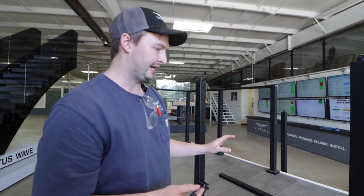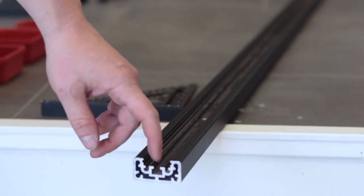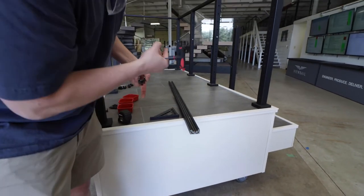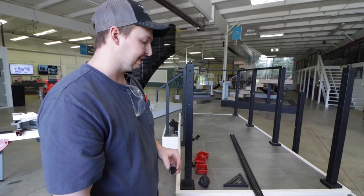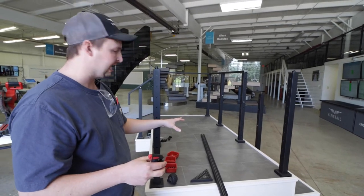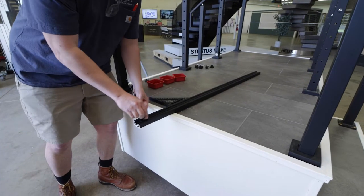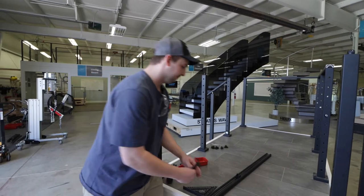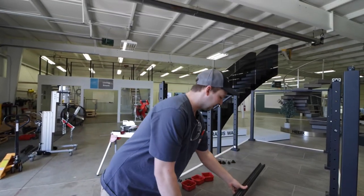Let's take a look at the underside of our quick slide profile. You can see there's a groove here — that's the orientation you need your T-nut when it's upside down, so that when we flip it over, the sides will be compressed into that channel, allowing us to tension up our posts. The reason we call it quick slide is not because you can quickly slide the handrail onto the brackets, but the opposite: we can quickly slide our brackets onto our handrail for however many posts, then move them into the correct location. You can lock them into place simply by tightening one of the nuts a little bit to keep them from falling down as you move things around — really useful when you're doing stairs.